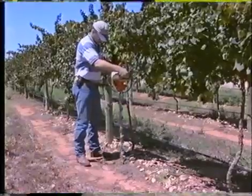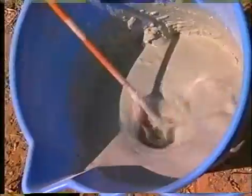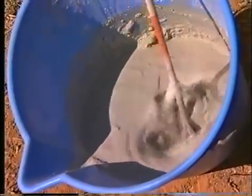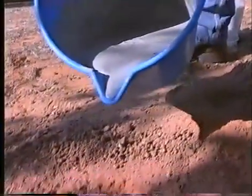In harder and rocky soils, Sentec has developed a slurry technique. A slightly oversized hole is augured first, either by hand or by machine. A slurry is then made using a mixture of kaolinite, or potter's clay, grey cement and water, which is poured into the augured hole.